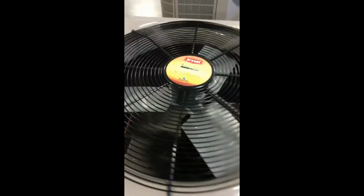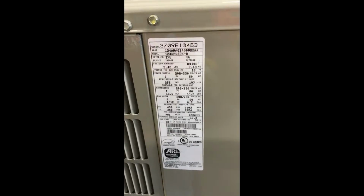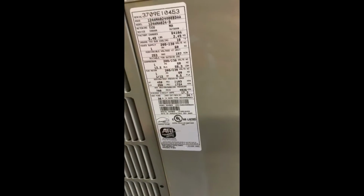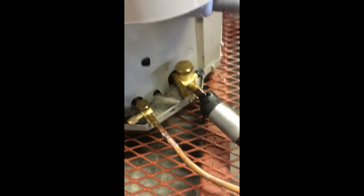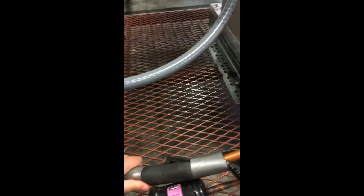This is our condenser unit. So this consists of our condenser, and you can see the compressor down in there. And here's another tag. It tells about how the contactor's in there, and the suction and discharge line. Suction's the big side. If you see the caps, this is what twists on and off, just like on our trainer that I showed you before, the other unit. This is our small discharge, and our large suction, it has a filter here, and it goes to the indoor.